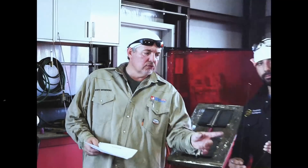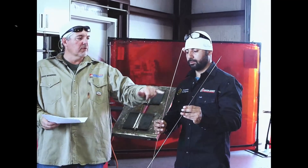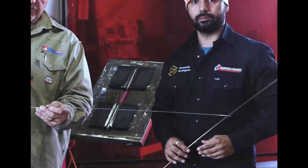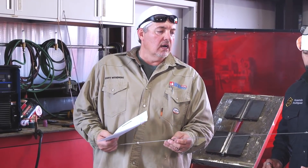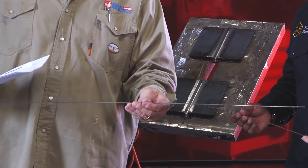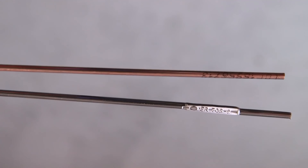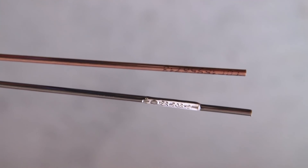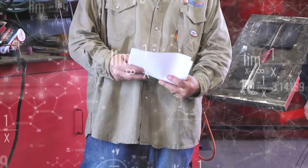Rosendo's got two types of wire here. One is a copper coated 70s2, which is what we've seen since we were sparkle babies, and then we have the non-copper coated filler metal. The only difference between the two is one has a copper coating and one does not. From a chemical perspective, the AWS classifications and specifications require manufacturers to make the filler metal identical.